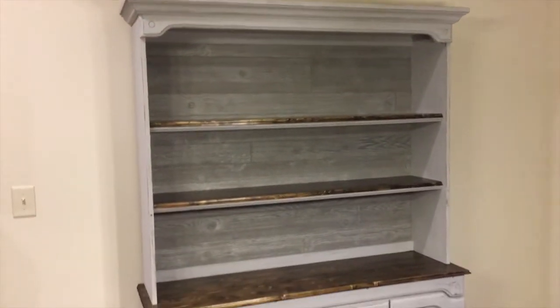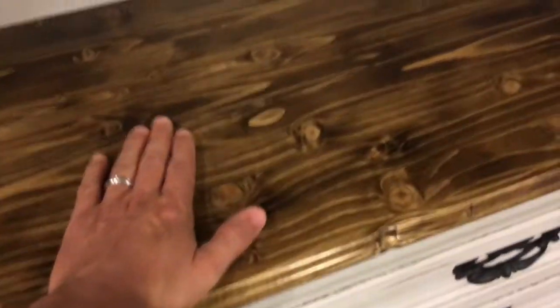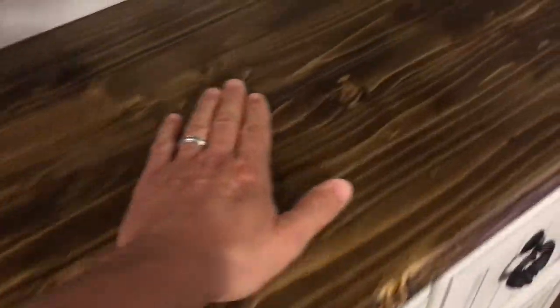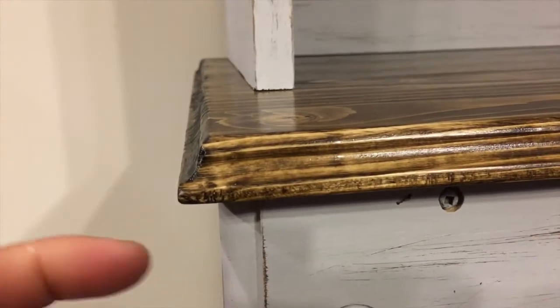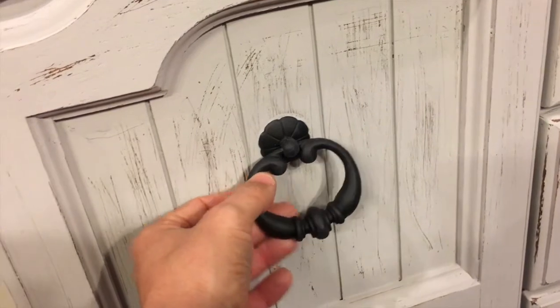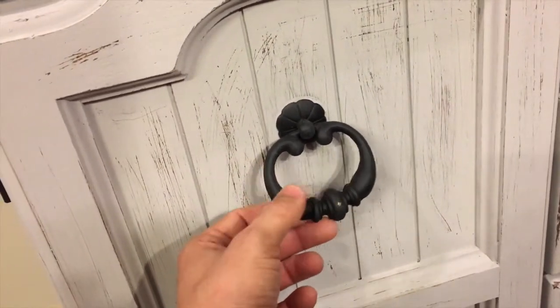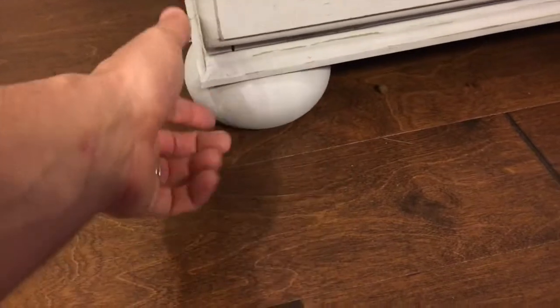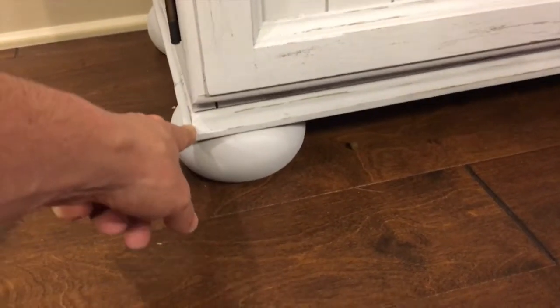Here it is — this is the china cabinet that me and my wife Heather made ourselves. We restored this thing. The countertops — we redid the whole countertop, this is actually solid real wood, newly stained. I used a nice router and put a routed edge on it. I redid all the edge work. This is the original hardware and I just spray painted it. I'm okay with it chipping — that was my whole intent because I wanted that aged, worn look. I don't want it to be perfect. The feet: it used to have a crown molding skirt but it had water damage, so I cut it all off and put a new skirt on it for more support underneath.